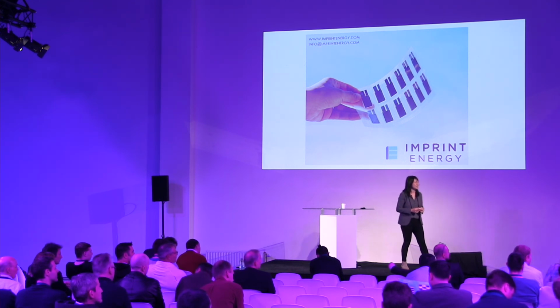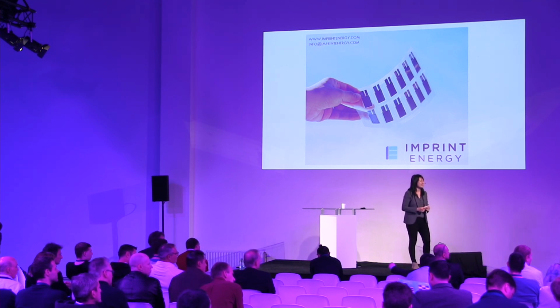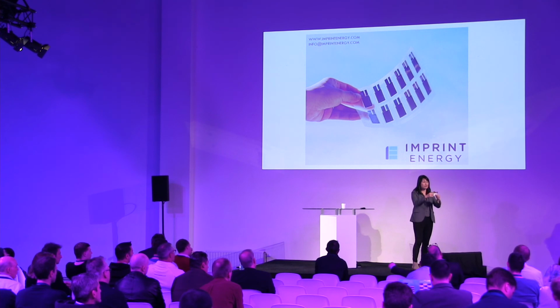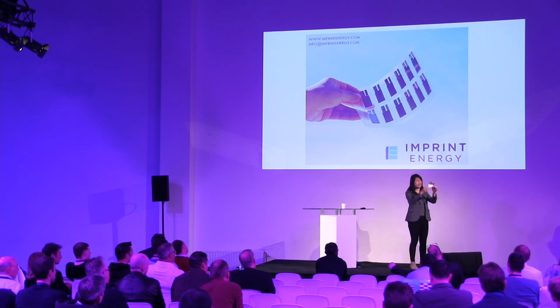Another question here. So what's the actual capacity of the battery in milliampere hours? For example, that one that you're holding. So this is a credit card size pack. There's actually 2 cells in series. So a single cell is 50 milliamp hours. And why we have 2 cells is this system needed 3 volts as a starting point. But bigger battery, bigger capacity, smaller battery, smaller capacity, and that's fairly linear. It's just like a area computation.